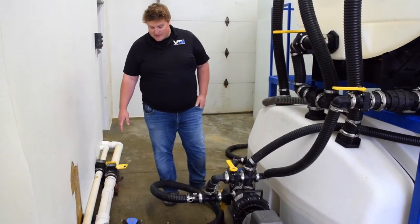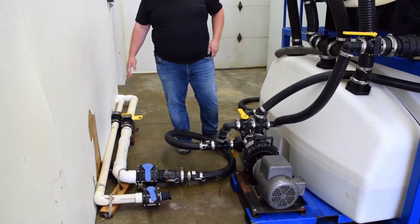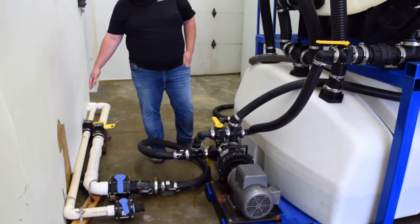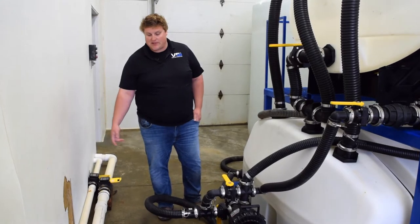We make our brine, pump it out to our storage tanks — we'll go look at those in a bit. It also allows us to pull the brine back out into the sprayers and mix in whatever percentage of calcium chloride we want to run in that batch simply by turning a separate valve.